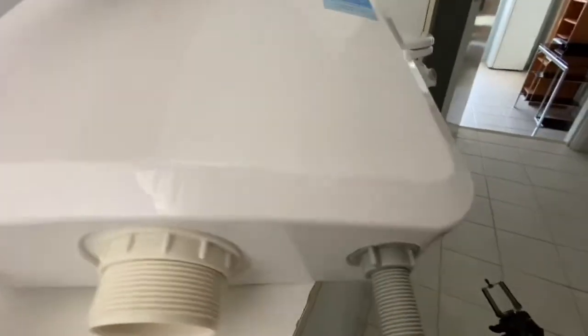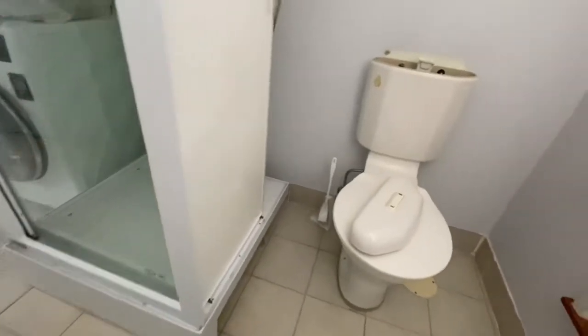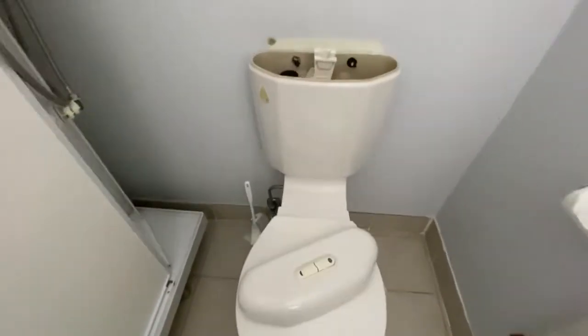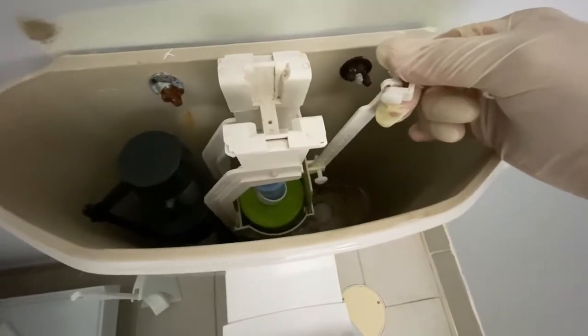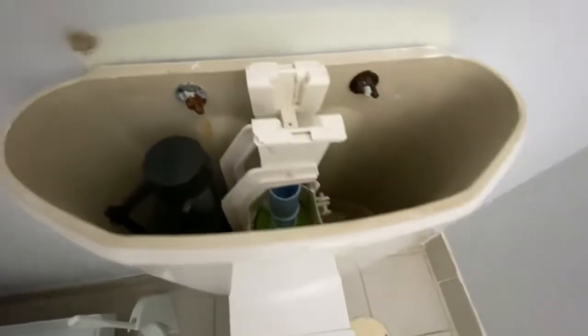The filling system I bought has the inlet on the right-hand side, while the one in store was on the left-hand side, so I just need to switch it around — I'll show you how that can be done quite easily. First thing you do is shut the water off. Then flush the toilet so the water empties as much as possible. This one is broken so I just do it manually. The water is empty and it's not filling anymore because the water is already shut off. That's the first step done. Next, I need to get to the bottom of the connections and unscrew from there.